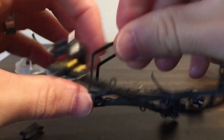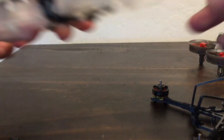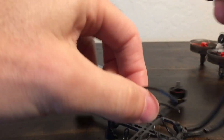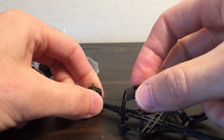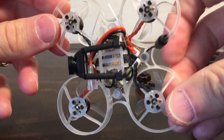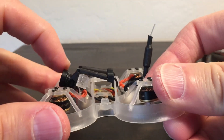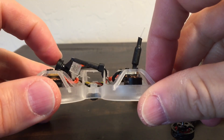You hold it down and crease it real good on both sides - that's what gives you that nice secure hold at the top. Once you have that bend, you take plain shrink tubing and slide it onto the zip tie. When your camera is in place, you slide the shrink tubing down into place and that's what holds the camera in from the top - the shrink tubing goes around the PCB board with the camera. Then you flex it to get your angle, measure on the piece coming back, and trim it at the distance needed to maintain the camera angle you want.